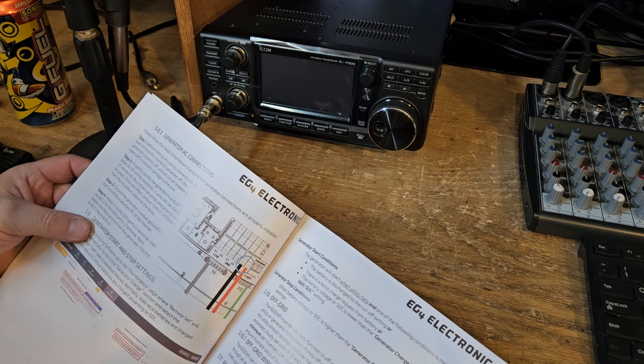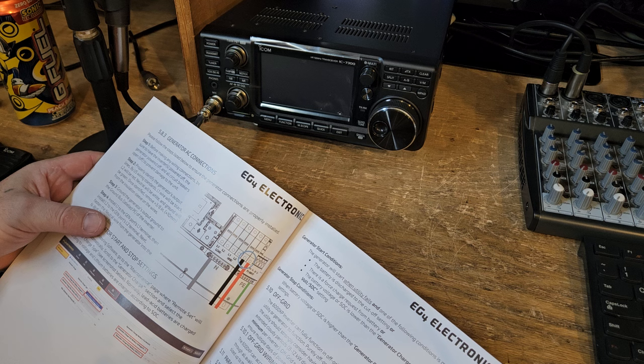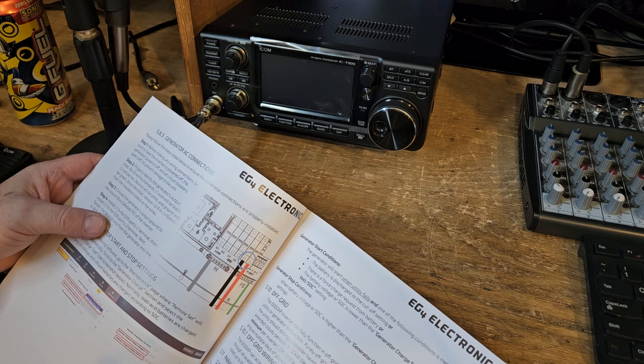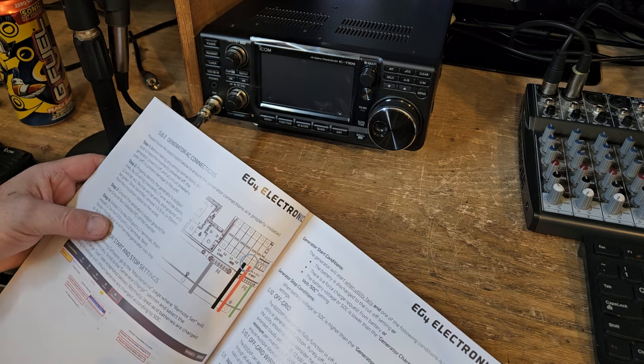Off-grid, an inverter can be fully off-grid, can fully function in off-grid mode. This does not need the utility or your generator to function. Purely off-grid systems that do not have access to utility should strongly consider having a two-wire start backup generator for extended cloudy periods. 8 to 12 kilowatt diesel recommended per each inverter. Wow. Off-grid systems should have robust battery banks sized to ensure multiple days of power and to reduce generator runtime.